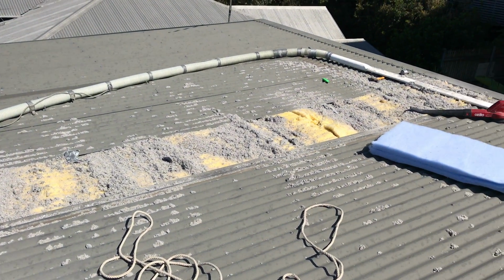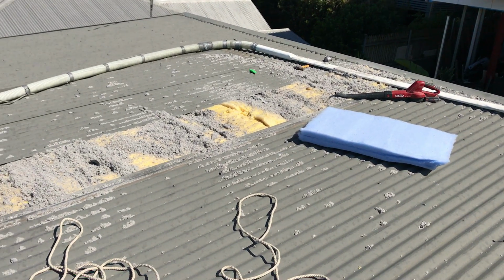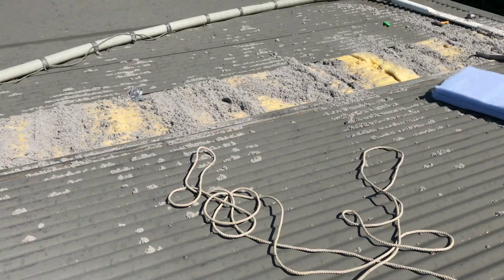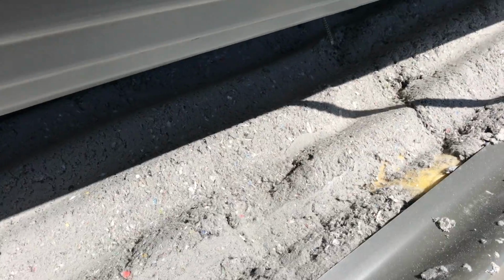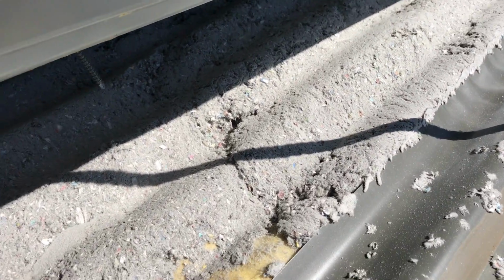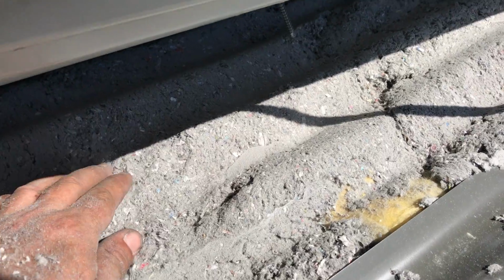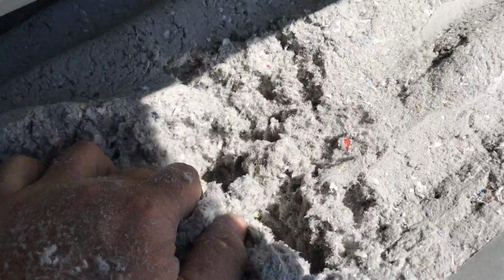Okay, so I've been pumping through with the flat pipe there, through onto underneath this rake roof, and they've got the rolled blanket there. I've just lifted this sheet here, and you can see that actually underneath this sheet it's all packed down nice and tight on top of the fiberglass. So this is how much extra insulation you actually get on top of your glass.